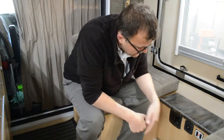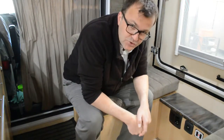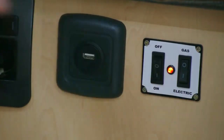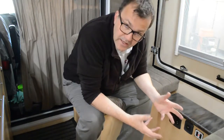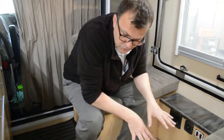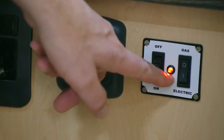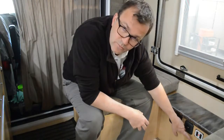If that light keeps on flashing, it means the system has not ignited. It is also possible that it will go steady and then a couple of seconds later start flashing again — maybe because it took an early ignition and there is still air in the system. So please, if you use the gas system, after about one to two minutes check the light again to make sure it is still steady on. If it is flashing, just switch the system off and switch it back on again.